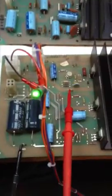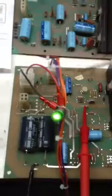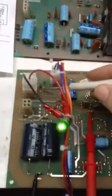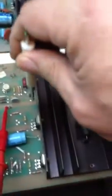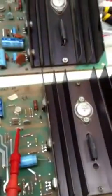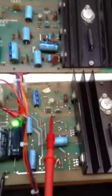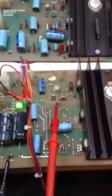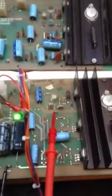A lot of times what commonly fails on the AR-1 is this diode right here next to J7, and/or this diode right over next to the heat sink. Those usually fail because of the sense lines — either do the sense mod or clip the sense lines. Either way, that eliminates that problem.